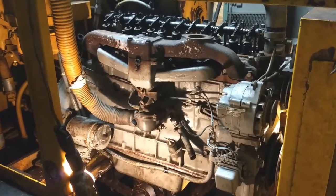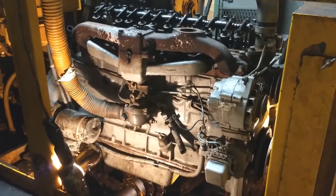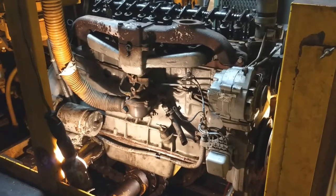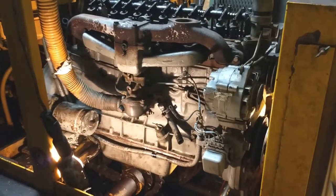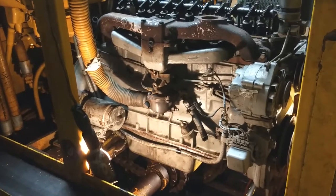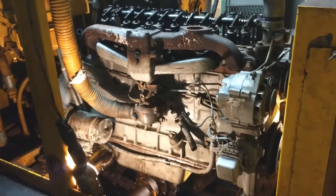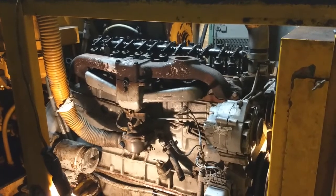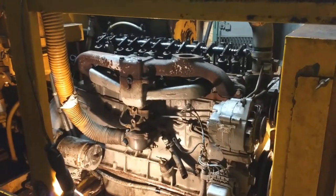Going into more detail on the work I've done: about a year and a half ago I asked the museum if I could start rebuilding it. When I first got a closer look, it was pretty much a basket case — the oil pan, head, and manifold were all off in a corner of the shop. Pistons 3, 4, 5, and 6 were still in the engine, seized fast, while 1 and 2 were already out. I spent about a week dumping automatic transmission fluid into the cylinders, then one by one tapping them out with a wooden mallet. After that I needed to get the old cylinder sleeves out — there was a pretty good ledge worn toward the top of the stroke, so it was definitely worthy of a complete in-frame overhaul.